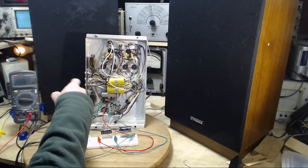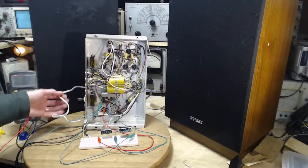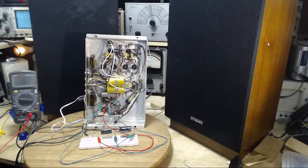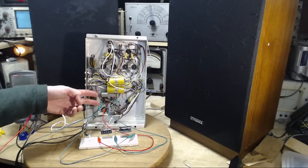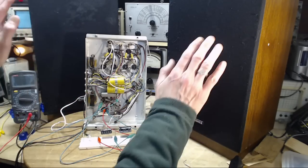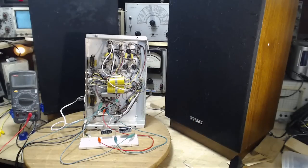The hum is either an artifact of how I've set this up, which I don't think it is. This is the hum level. I don't think the designers would be happy with this. I think they would want it to be hum-free. So I've got to put these up to hundreds. Each one, put 100 here, doubling the capacitance here. I think the hum would just come down a little more. I don't think it would disappear. I don't think this is the whole picture.